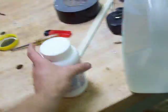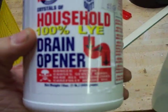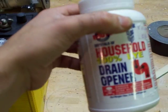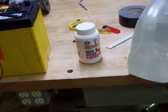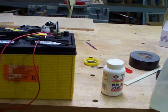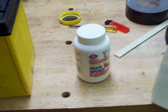Right now I'm messing with 100% lye — it's sodium hydroxide, which is still corrosive. So I ended up ordering some KOH online, two pounds of that, because potassium hydroxide is not quite as corrosive. Really, sodium hydroxide and potassium hydroxide are what I'm hearing is your best bet right now, because it's not so corrosive, it works good, it'll keep your cell running at a relatively low temperature, and it doesn't dissipate its power until you get into 300 degrees or something like that.